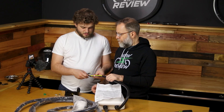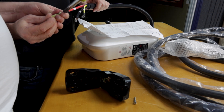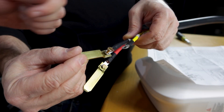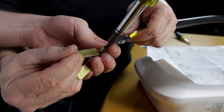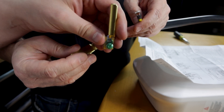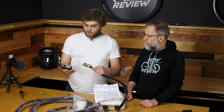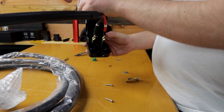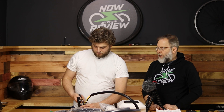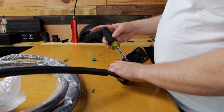Let's take any one of these. That looks like a nice connection there — make sure you crank it because you don't want any arcing. Then we're taking the ground blade and putting it on the ground — that one has a Phillips. So now we have all three lugs with their blades on them and we can start to insert them into our plug. It's good to dry fit what you're doing, because in this case Jesse's turning these 90 degrees so they'll fit into the plug — a lot of times when you're doing this outside of the plug you can't really picture what you have to do. So he's turned them 90 degrees and now he's retightening.